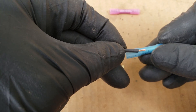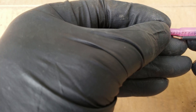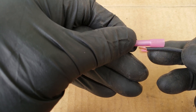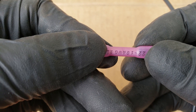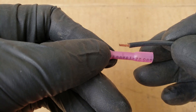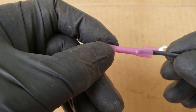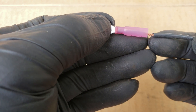If you'll notice, this wire is definitely too thin for this blue connector. When it comes to the length of the wire, you want to avoid it being too long where the wire sticks out, or too short where it won't get crimped properly. You can measure it up to the terminal to determine the proper length. There's a little dimple in the middle, and that's basically where the end of the wire will hit — so any longer than that will end up sticking out. The same goes with these other terminals — you want the wire to be about the same length.